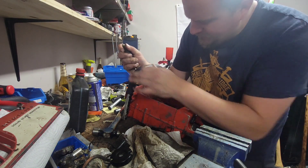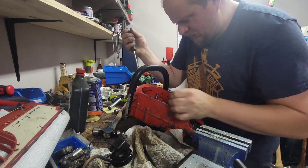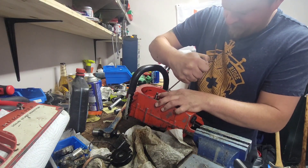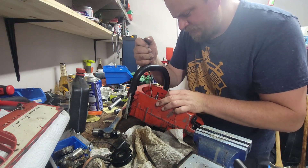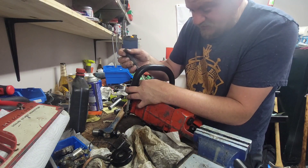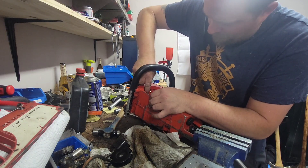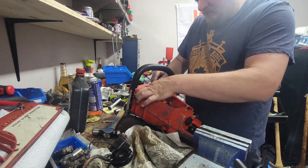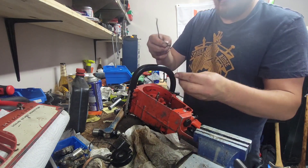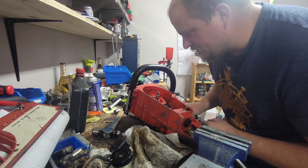Let's go take a look at this crank seal. As discussed with that other saw - the 4F - it definitely needs a crank seal. That one looks like the crank seal was actually replaced before. You see how slimy and gooey that is? Kind of tells me that the crank seal is done because the crap was definitely leaking past it.